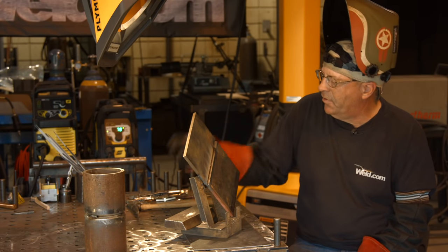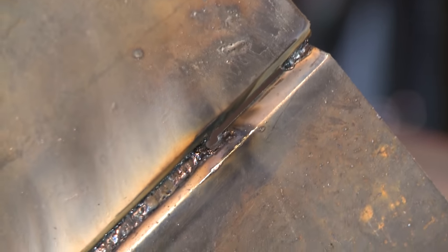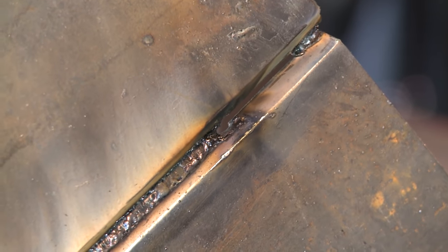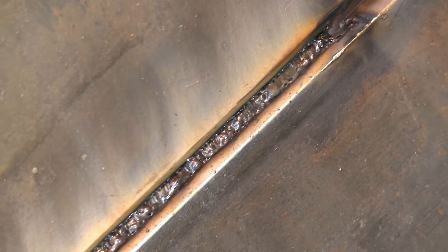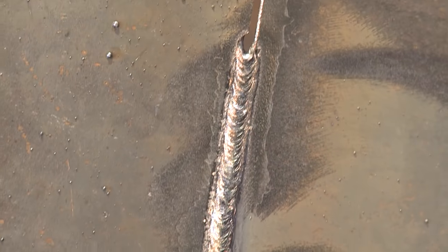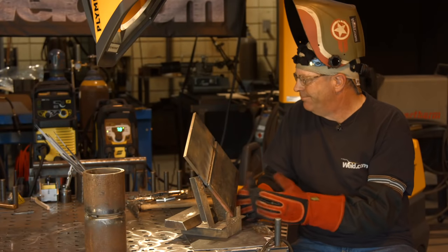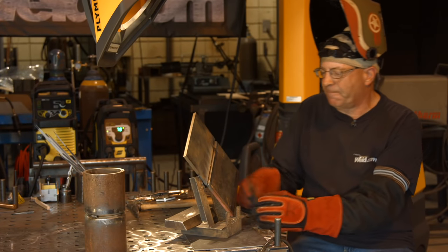I'll run that up there and just stop, leave the keyhole so you can see the fit. I'm going to buff this out, maybe knock the top of it off, then come back and run a little hot pass in here. We have options of going straight to a fill pass, but I want to run several passes so you can see it.